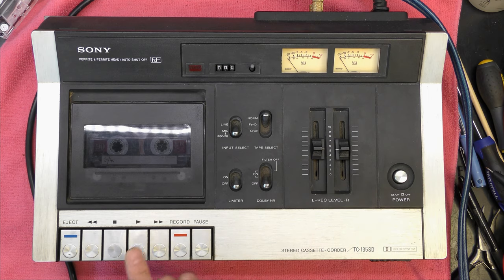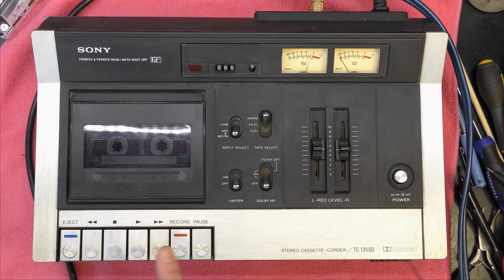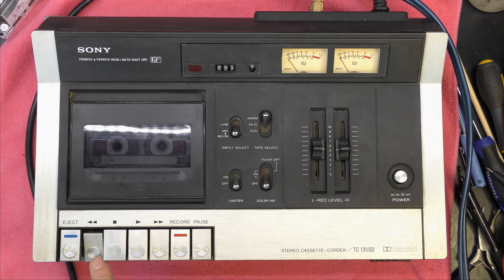I've got a couple of mic sockets on the front and headphones, so I've got it powered up and I'm going to see what happens. Well, immediately I can see that the take-up capstan is not working. We've got one channel not working — only the right is working, the left's just fluttering around. I'll just rewind the tape so I don't get a tangle. Rewind's working, fast forward too, but definitely no take-up.